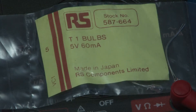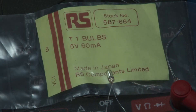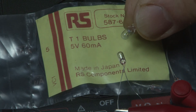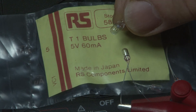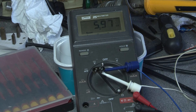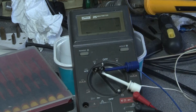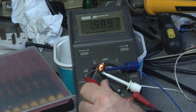There's a quick look at the type of bulb I've managed to find: 5V, 60mA — very close to the specification of the lamp that's failed in the resistor, so we'll give those a try. That's what they look like — a tiny little bulb. Compared with the one that's failed, there is quite a difference. Here we have the photoresistive part of the resistor connected up to the multimeter. With ambient light we've got a few kilohms of resistance; if I cover it up, the resistance climbs to several hundred kilohms; and with the light bulb held close to it, we can get down into the hundreds of ohms.